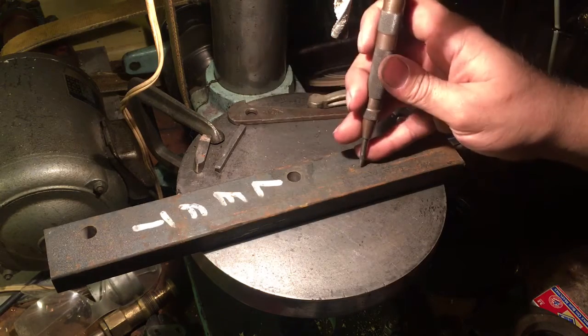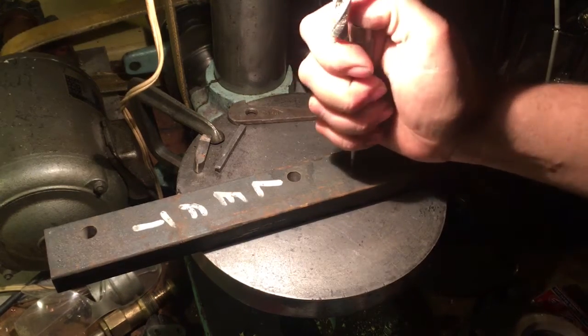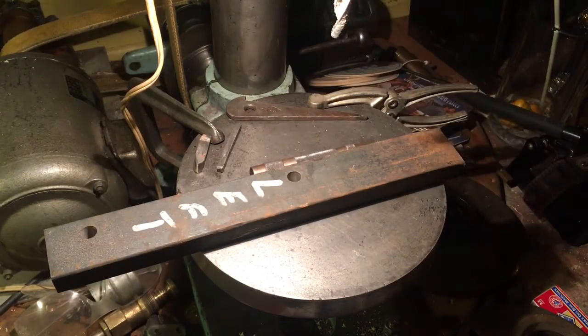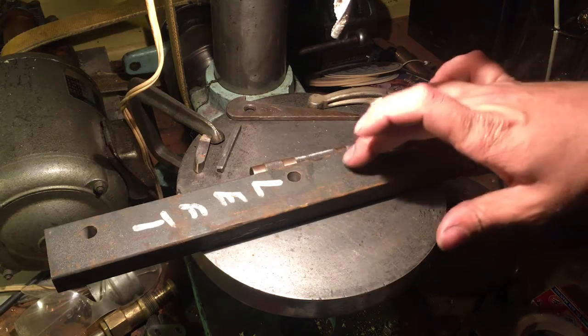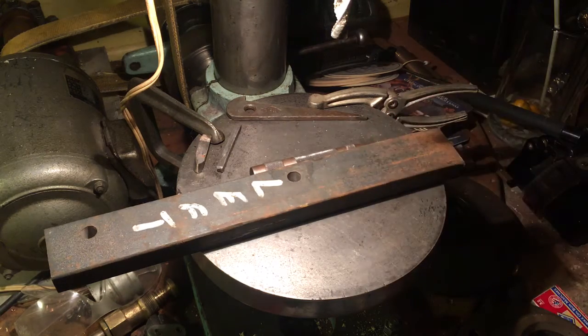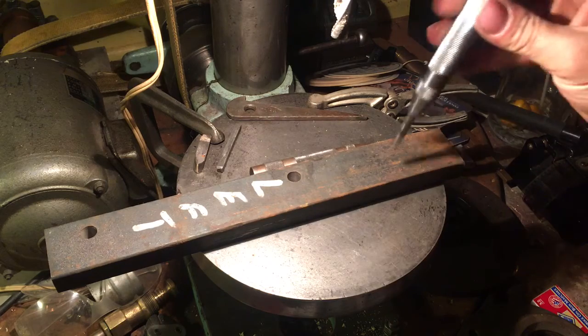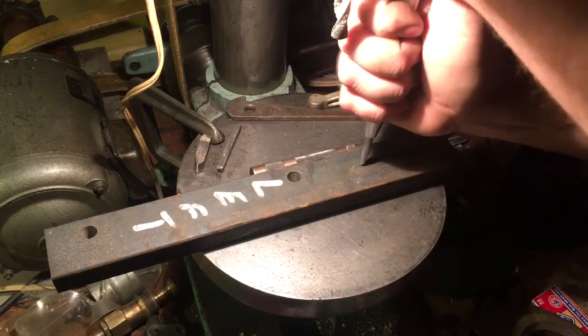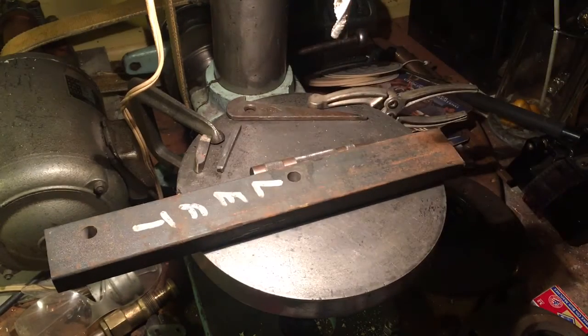Usually I'll do that if I'm going to drill a few times — to get it deeper for a small drill. But for a larger drill, I usually have to come in with a center punch and a hammer and give it a good whack or two to get a nice punch mark for the drill to start. I'd been wanting an automatic punch that would hit a little bit harder.